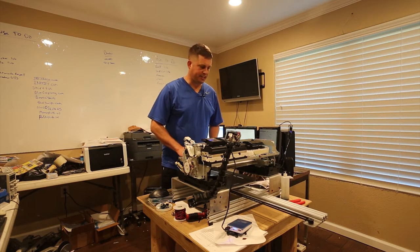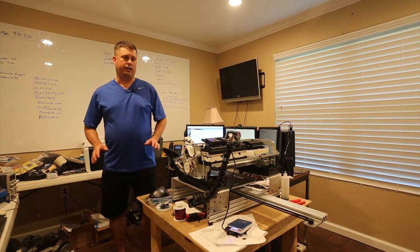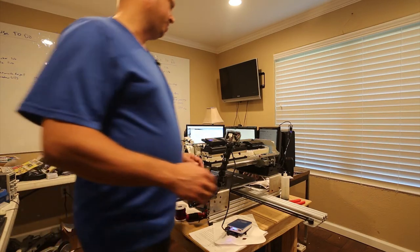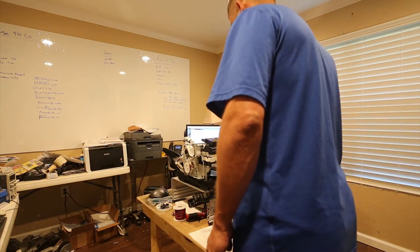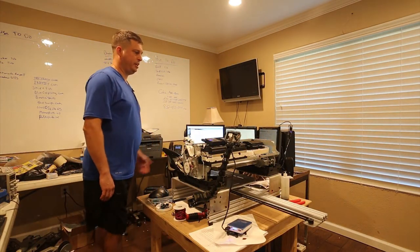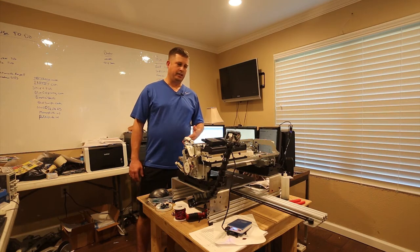The printer still thinks it has paper over here, so you need to put the paper really, really close to the side. Okay, and then you just go in here and you run a nozzle check, and the print head will come out of its little cave and it'll run across here and run a nozzle check.